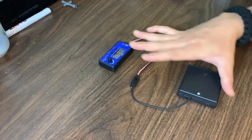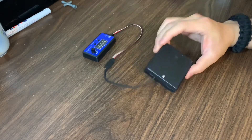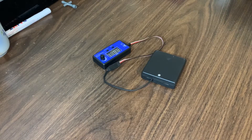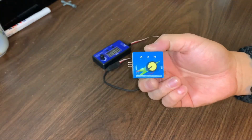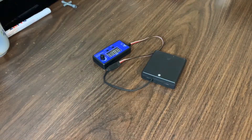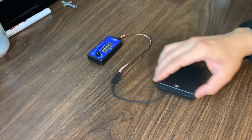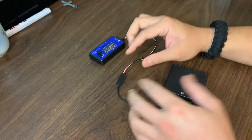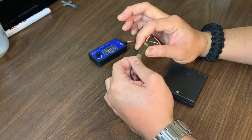This whole combination cost me probably less than 10 bucks. The servo tester was running about 5 bucks and the battery pack was about a buck fifty — I bought both on AliExpress and I'll link both in the description below. Keep in mind there are cheaper servo testers that look a lot like this; I would not recommend those — I had a lot of problems with them, as I'll show you later. I would stick with this style of servo tester. Also note this battery pack did not come with a JST plug installed, so I had to do that myself. If you don't know how to connect JST plugs, learn that first because it's going to be really important in the RC hobby.